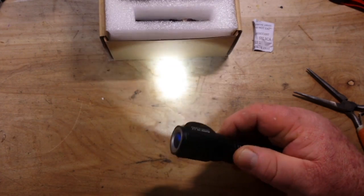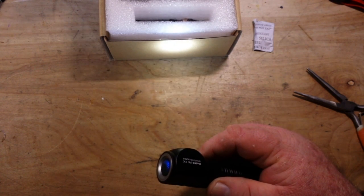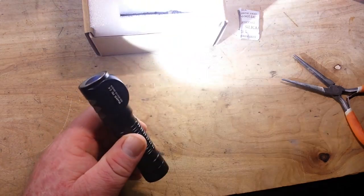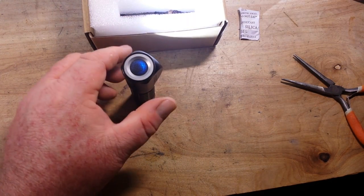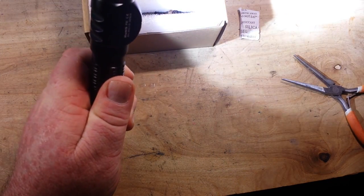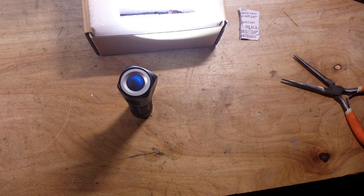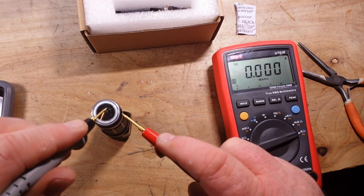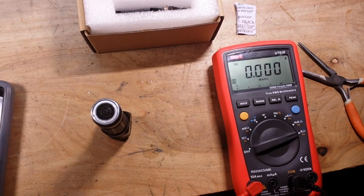I charged the battery up when I initially got this a couple weeks ago with the included USB cable. We're going to run it fully down and then do a full recharge to see how much capacity it actually has. It has been in turbo mode for about two minutes and that is about as long as I can hold on to it. Down here it's hot to the touch but I can still hold on to it; up at the head it is too hot to touch after just a minute or two. Let's see how much current it's using at full power — 9.3 amps on turbo mode. That's quite a few amps.